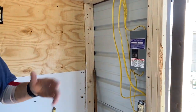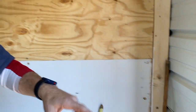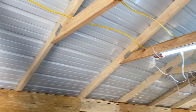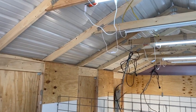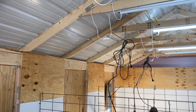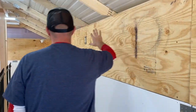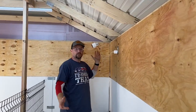Once we got the electrical panel installed inside, we ran a couple of different legs of electric. One circuit is for an AC unit of some sort. We've got a couple of light switches — some for the internal and one for the external. The lights are on plugs so we can swap out these barn light strips if we want to. We have six plugs for that. Then there are orange plugs on a different circuit designed for heat lamps or fans so we don't overload things. We also have some extra wall outlets for plugging in specific items like our camera, which is always on so we can check in on our little baby boys.